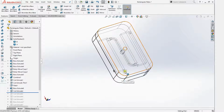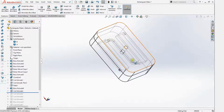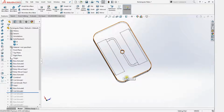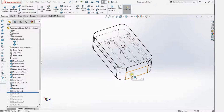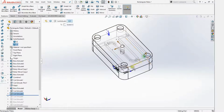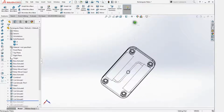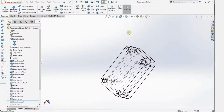So if you just went and shot it like this, it could probably work somehow, but you would have some crazy flashes everywhere, and things wouldn't sit probably unless you made it a complete tight fit, but that's really difficult to do. So what I want to make sure is that these 2 parts are clicked together and screwed together. So I'm actually making screw holes here. So holes throughout the part, and down here making room for nuts.